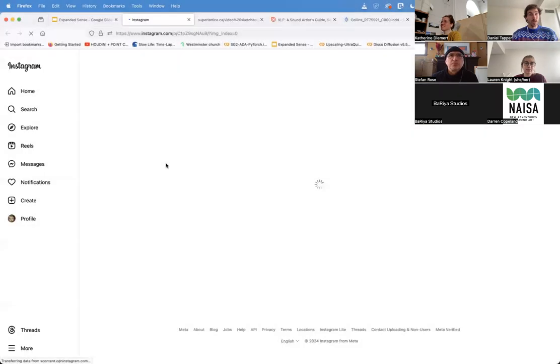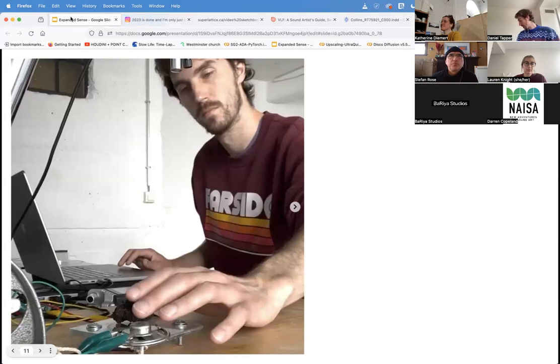Another way I have ended up repurposing some of these transducers is, let's see, I'm just going to grab my... So this is what the hydrophone I built looks like. It's built from a design by a chap who was trying to record mollusks being eaten by sea parasites. It's really simple, but mainly it takes a piezo disc, like the kind we'll be using later today, which picks up vibrations, and seals it. There's a rubber washer in there, and then it's sealed within some plastic, so that you can put it into the water and it's not going to get wet.